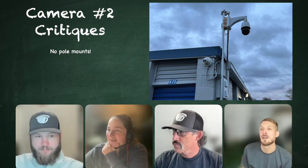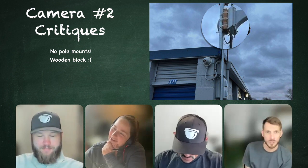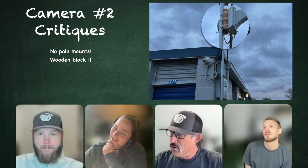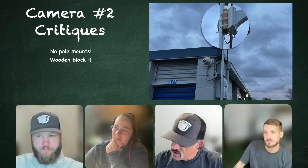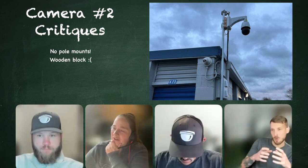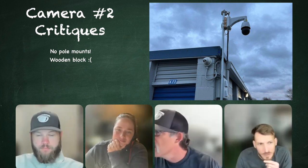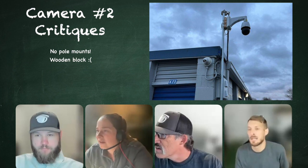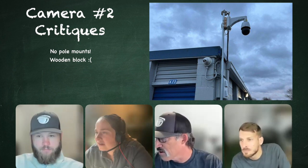I think the reason that I forwarded this photo is just the wood block. Wood kills me. Anytime you install cameras with wood, it's a no-go for me. Why'd they do that? A little weather rot, because the pole's too small. They're not ratchet straps. What do you call them? The straps won't tighten down far enough. Yeah, with our pole mounts, the pole or the mast that it's mounted to has to be at least 2 inches. This one looks 2. I think it's 3. No, it might be 3. I could be wrong too. Yeah, and look how close though, the actual pole mount adapter on it that's hooked to the wood.